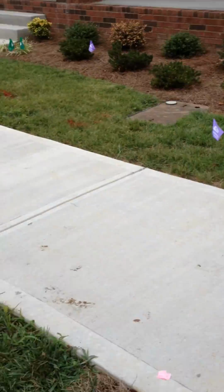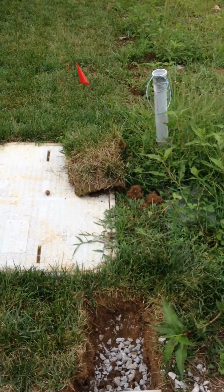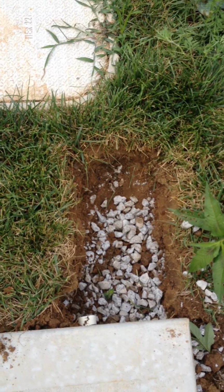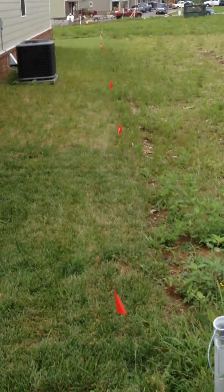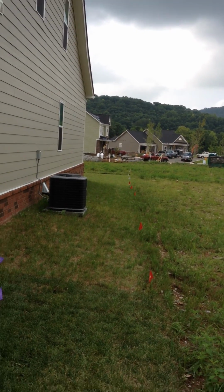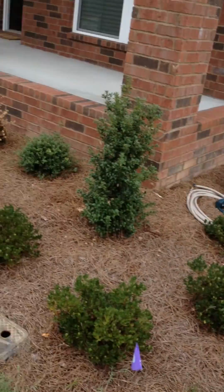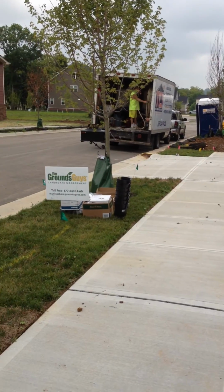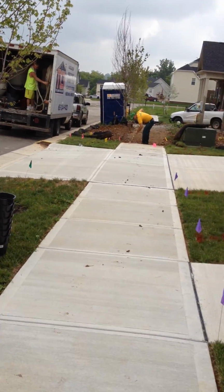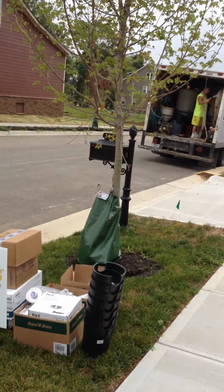Okay. And then the main line will also come off of here, as you can see, where the sleeve head pokes out, and then it's going to end up running water down into those valves. Each valve controls each zone. Therefore, you can see we have 7 valve boxes that are stacked here. Each valve, as I said, is independently controlled and manages that zone.